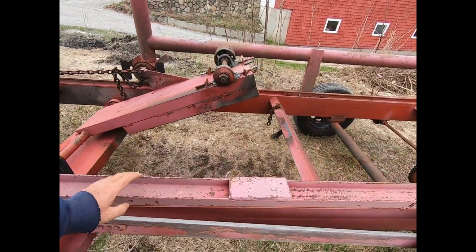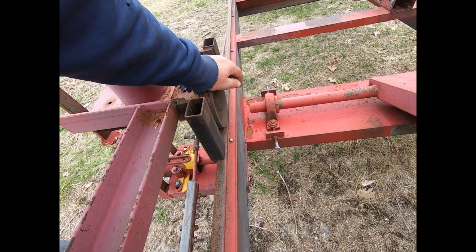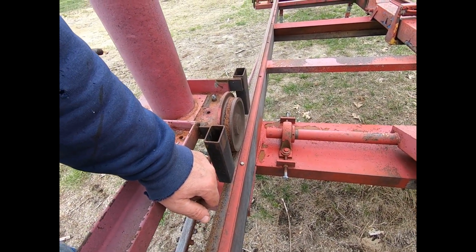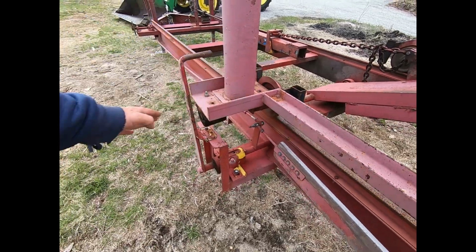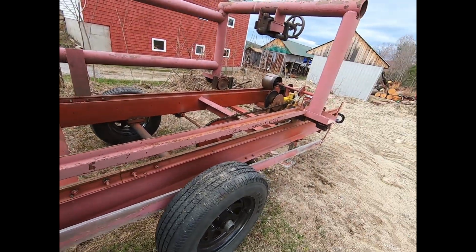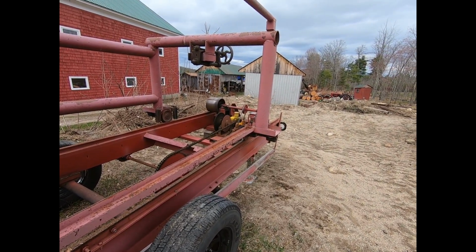So this was a piece of channel iron just laid around. A fella let me have the wheels and crank of a sawmill that he scrapped. So that gave me my bearings and my wheels. Of course, they were on a solid axle, and I just cut them and shortened them, fit them in there. So there's 2 bearings and half a set of wheels on each corner.